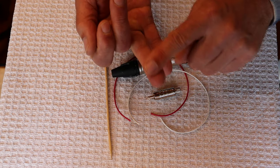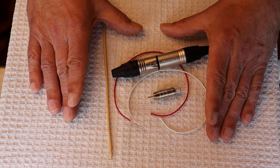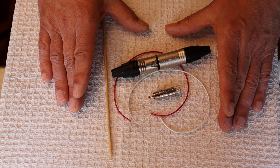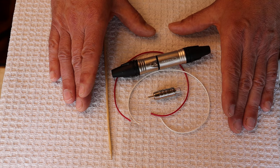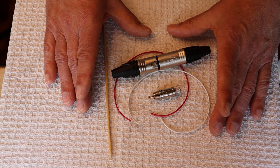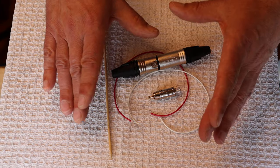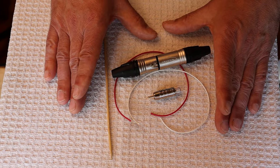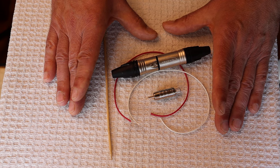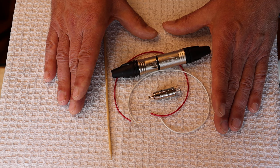So we've run through resistance, capacitance, noise rejection, and functionality. As we move forward this year, we're going to have kit cables coming out — first to test builders and then in the store for very affordable interconnects. We'll talk in more detail about how to test your cables and what the important specifications are. You can do a lot of cable testing — all the important testing — at home quite easily with a good quality volt ohm meter and just a little bit of knowledge. So you can test your existing cables, write a spec sheet up, and we'll have specs for all of the cables so you'll be able to compare them to your favorite cable type, and even test whether manufacturers are being truthful with their specs.